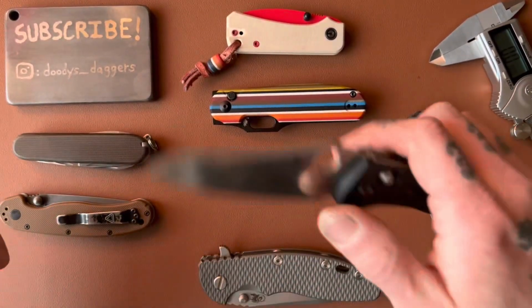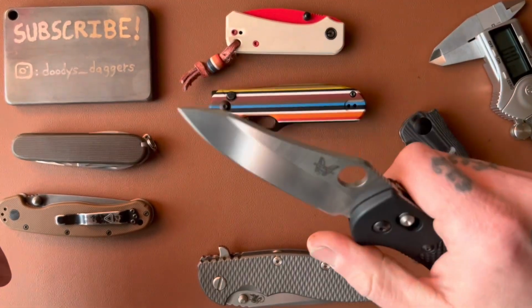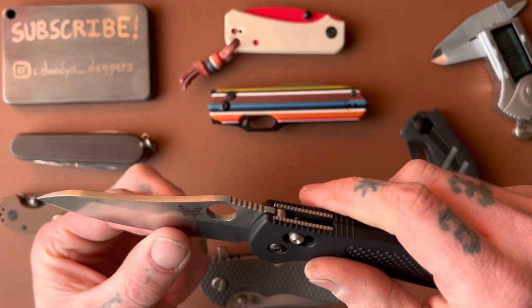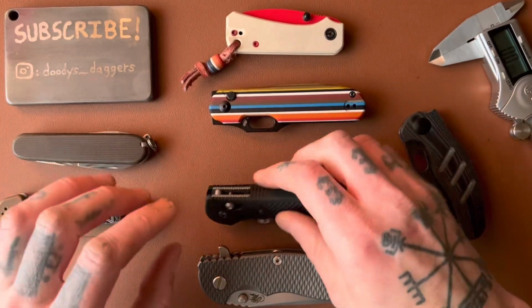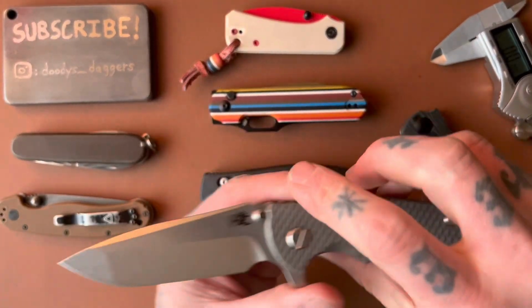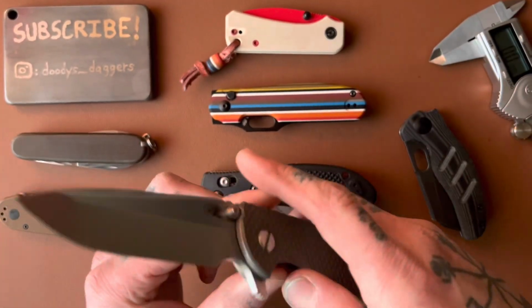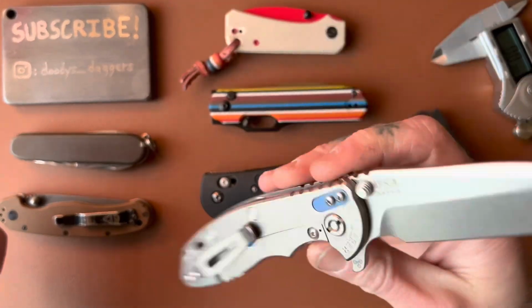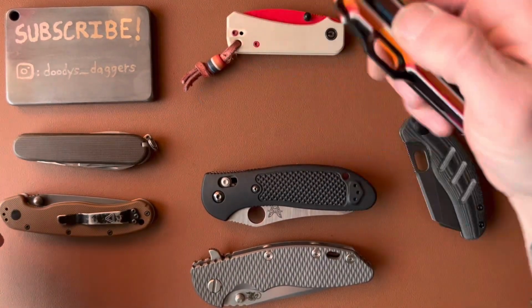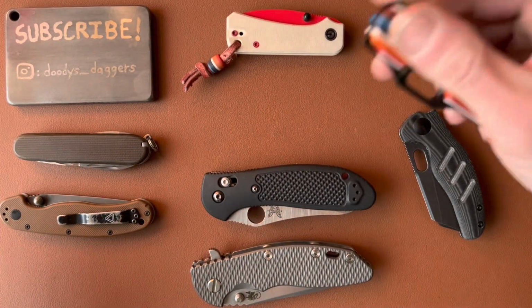27 is a little bit excessive even, I think, for this Griptilian. It does not need to be that thick, in my opinion. This is a fairly hard use knife, but I don't think it needs to be that hard to use a knife. The Hinderer, I think, makes a little more sense. It's really big, beefy, kind of overbuilt knife. I think that makes sense for it to be 25, 26 thousandths behind the edge. I'm okay with that one. But, if you want to be super duper slicey, you want to be in the 15 to 18 range, probably.